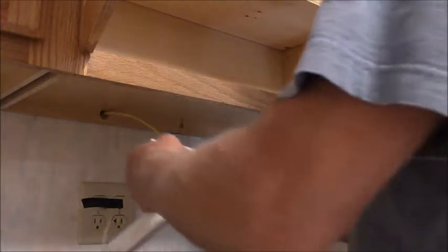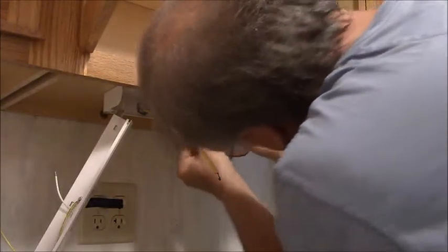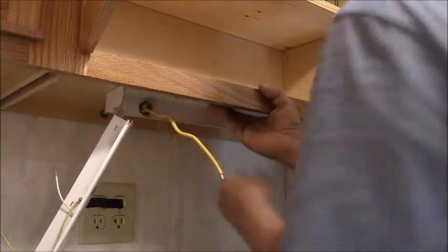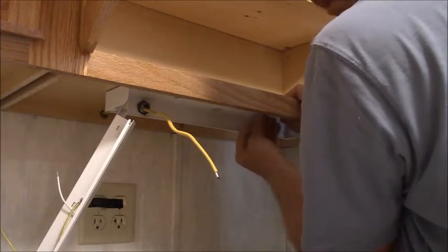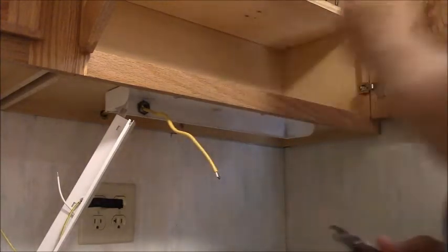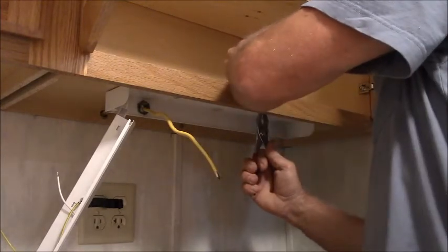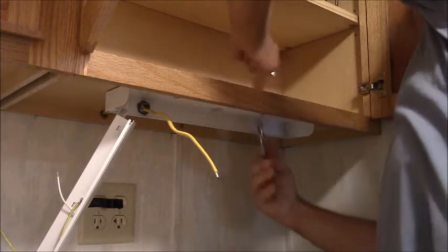Now I'm going to slip this wire through there — that is just long enough to catch that nut, which is what I wanted. I didn't want a lot of this screw sticking into the fixture. If you've got fluorescent types that have tubes in them, this is a little bit more of a pain — you can't have hardly any of this bolt stick through because it hits the tube. I knew when I tightened these down it would suck that head right down into the wood.